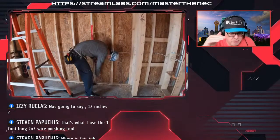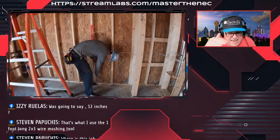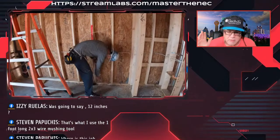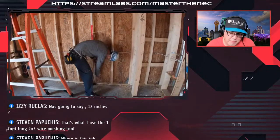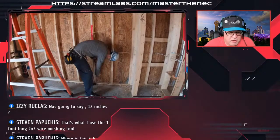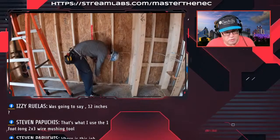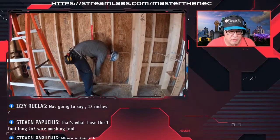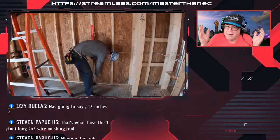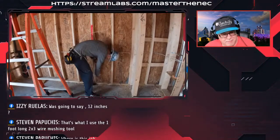Now, could it be at 6? Could it be at 5? Could it be at 4? Could it be at 7? Absolutely. But the maximum you can go is 8 inches. His jurisdiction, they're telling you that they want it at 6 inches. Okay, again, unless it's something that's adopted by the jurisdiction, that might be the inspector imposing his own will, but maybe the inspector just doesn't know that you can go up to 8 inches. So this gentleman's wrong, and maybe his inspector's wrong. So maybe they will watch this video, and they will understand that they could go up to 8 inches. But if you do it within 6 inches, you're still going to be compliant. So his inspector's just trying to keep him compliant, all I'm saying. But he said 12 inches.